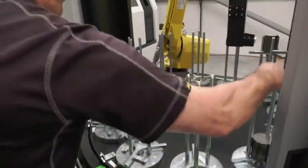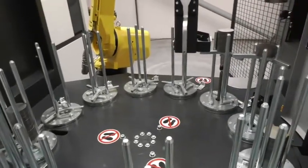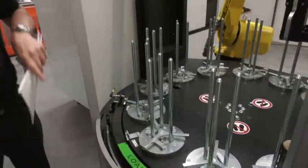A couple of quick things on specs: weight and diameter. Weight on the stacker is 1,250 kilos; on the universal with the grid plates it's 750 kilos. Maximum diameter component on the stacker is 230 millimetres. What about the robot arm payload? This particular arm is a 20 kilo arm — divide that by two because you've got two grippers, so 10 kilos a side. On the universal we've got a 35 kilo arm, and we're increasing our range considerably, going even bigger. Steve, clearly passionate about robots — automation made simple. That is the Halter Technology Center.